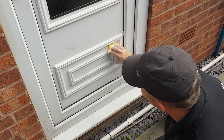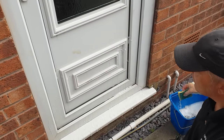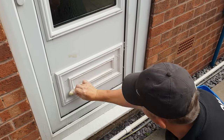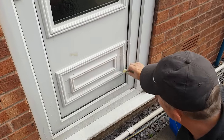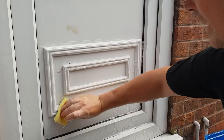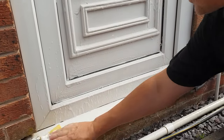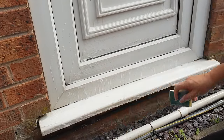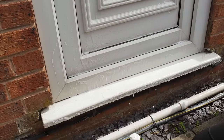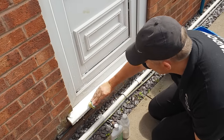This is how to do it with the traditional door restoration — we get right into the top of all these gaps first. Why? Because crap sits on the top ledges. As we get in here we start to notice a lot of this is coming off quite easily, including the green algae. I'm using nothing more than Poundland scourers. Always take off the surface crap first, otherwise all you're doing is rubbing the surface crap up and down and potentially causing more damage.